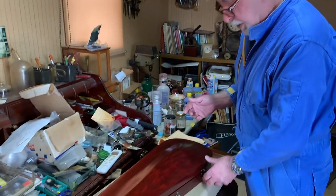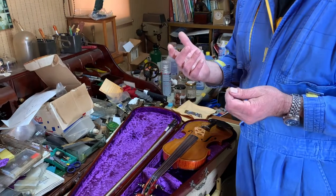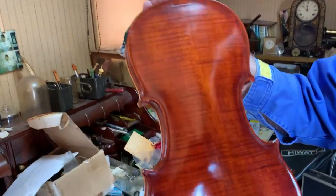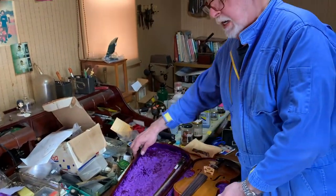He said, what's that? And I showed him. He made acoustic guitars, but he would put an oil on the wood. To me, that is really funky, because it's actually closing the pores of the wood. It won't vibrate as much if it's clogged up with oil. For sure. So when I showed him how to use shellac, and you can see the depth, that's French polishing. It's really deep. He did one, and he came back weeks and weeks later and said, that was amazing. Where can I buy more shellac? I said, internet.